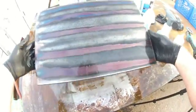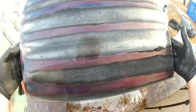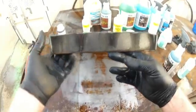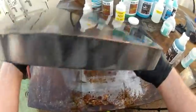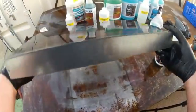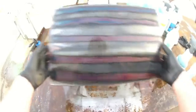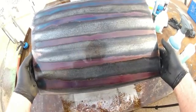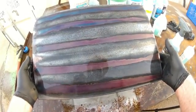For what I have out here right now, that's about all we can do. But you get the idea that on galvanized, there's not a whole lot you can do with patinas until you get rid of some of that coating. And then it's anybody's game to come up with different ideas and different strategies on what you're going to use as far as patinas. I didn't concentrate on the sides or edges — I wanted you to see the basic process of getting the zinc and tin off, the galvanization, and putting some basic patina colors on.